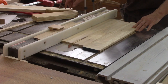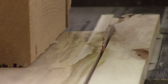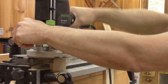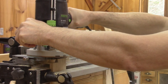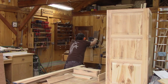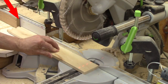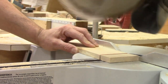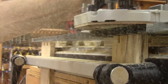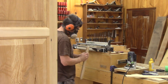It's time to take care of the sides. I begin by cutting only one side straight. Since the sides are asymmetrical, I have to make two different setups on the jig. But this way, I'm able to cut both sides at the same time. When all the dovetails are cut, I can cut all the sides to the same length. Then I change the jig setup and cut the back tails. Eventually, all the dovetails of the sides are done.